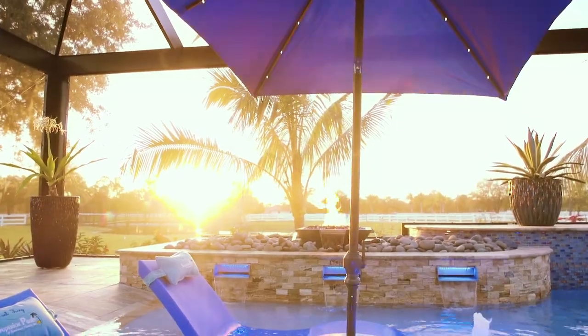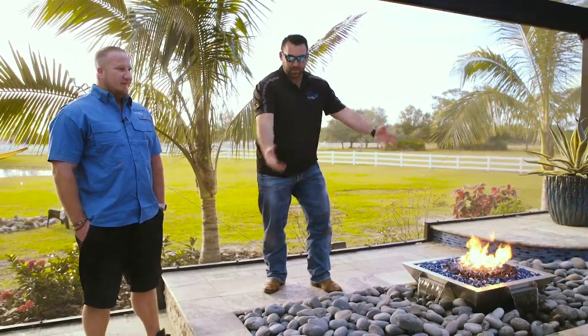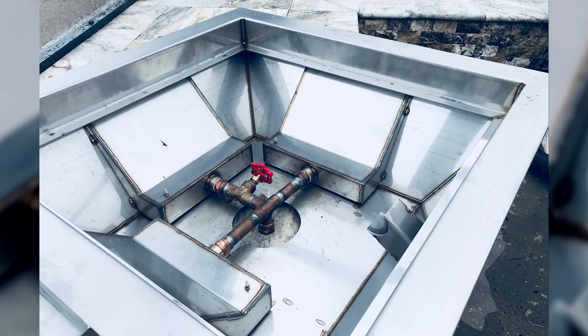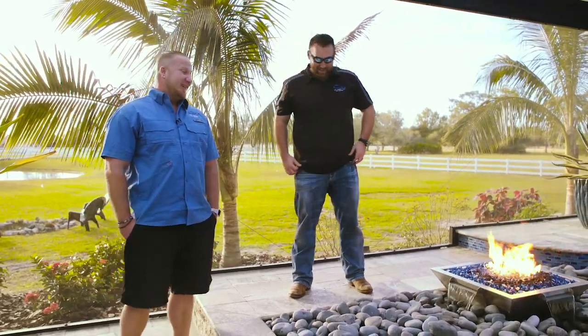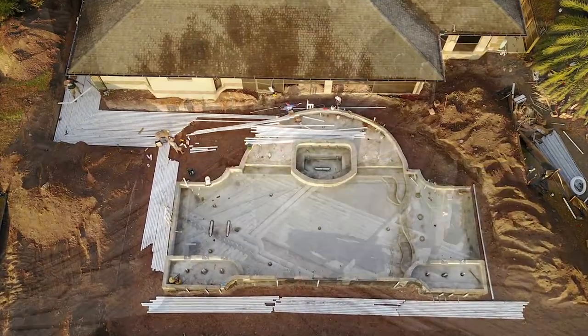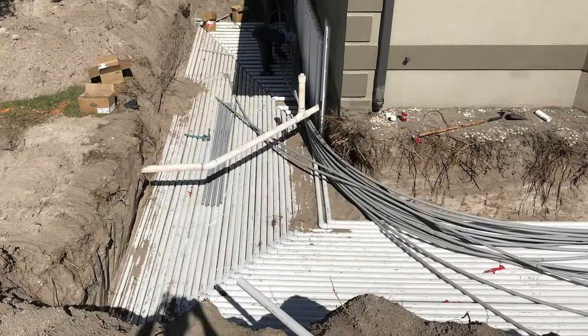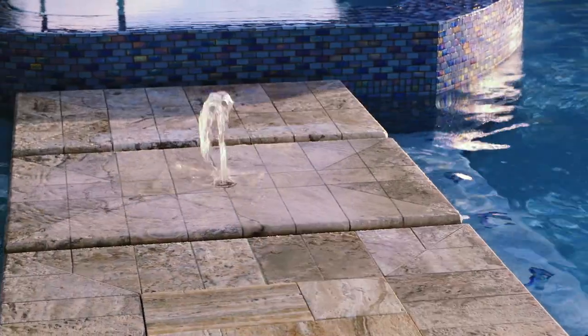It's basically all gravity-driven. Normally on a water feature you have a plumbing pipe going up to your scuppers and you're forcing water through it, but here we just wanted it to spill over — these are pass-through scuppers, so water just spills out into the pool. That was another big challenge when we were figuring out the hydronics on the pool, because to get all that to flow evenly it took a lot of calculations. Once it's done, it's too late — not much you can do at that point. The plumbing on this pool is the biggest we've ever done; it was amazing how much pipe and how many lines it took.